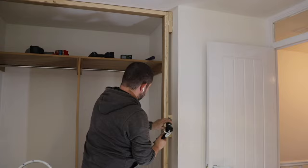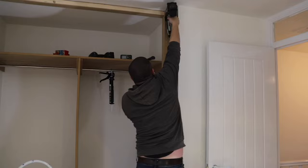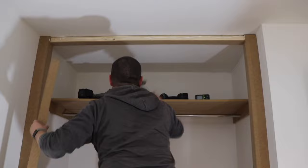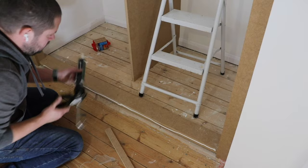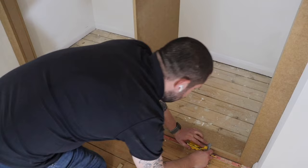Pinning it also means there won't be as much making good to do. On the face here we're doing 18mm MDF. I actually cladded the insides as well — it was quite hard to film, but I've essentially made a boxed section around all of this so you never see any horrible bits inside. Doing the same on top and bottom just dresses it up and gives you somewhere nicer to decorate.